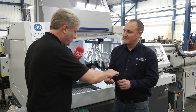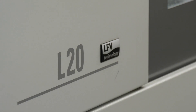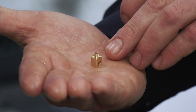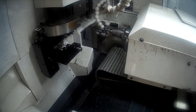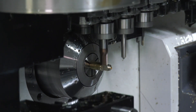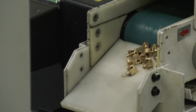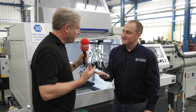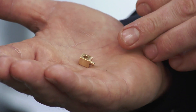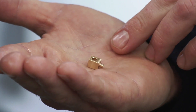You've got that - we mentioned the old Citizen - and you invested about 12 months ago in the Citizen L20 LFV, and this is a great example of what you're making there. Yeah so this is a 50,000 part run, this brass part, very fast machine needed for that type of quantity - it's doing about a 20-second cycle time and very productive. With the material being brass we can run it over the weekend and it's still running Monday morning, so that's very nice. Just talk us through what you're doing on here. So turning from round bar, drilling on the front, milling the square, cross drilling, and then on the back we're doing some drilling and threading as well.